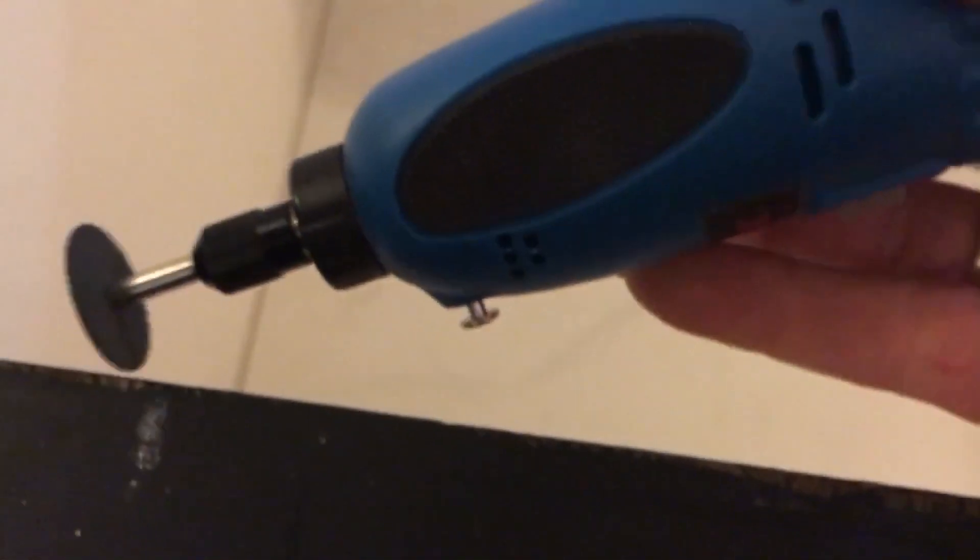I'm just going to take my little rotary tool now and cut out the recess for the hinge, and then chisel it all out. You cut little strips in it — it makes it a lot easier to chisel out. I've put the hinges on now and I've painted the inside of it all black. It's just about completed.